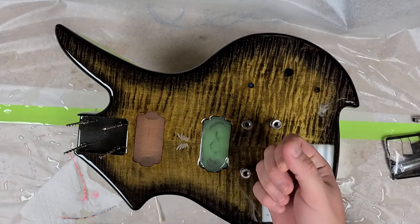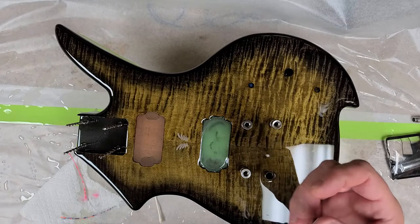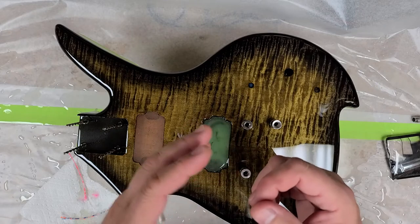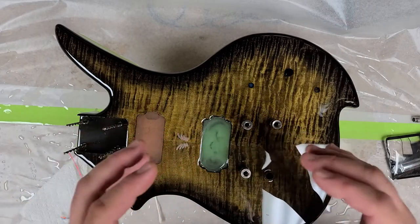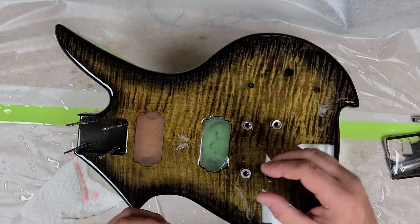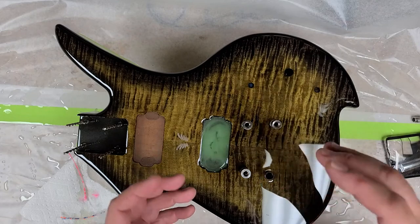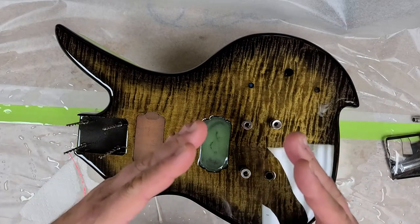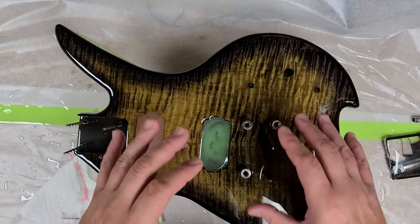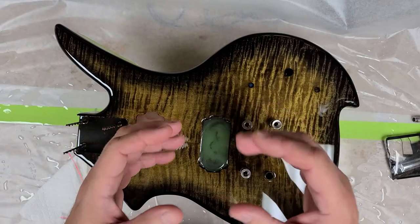Well, wax. Any type of automobile wax, whether it's a paste or a liquid, if it's a liquid, rub it on the end of your drill bit or whatever you want to put into the finish. Make sure you go up, don't just put it on a little part of it, but do the whole side of it. That way, if any epoxy does touch and go up the edges of whatever you stuck in the epoxy before pouring it, it doesn't stick to it.